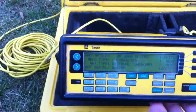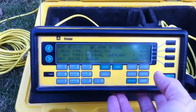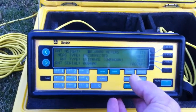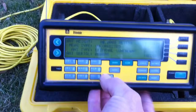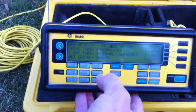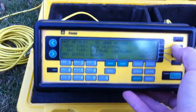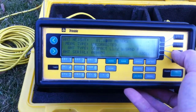Get ready to input antenna height. This is an uncorrected height. You're going to have to read up on the manual about the required format. I think this is a slant height when it says uncorrected, but please check that. I'm going to go ahead and enter the height as 1.5 meters. You can come down here and enter the antenna — it will be uncorrected. Compact L1, L2 with ground plane — that's the correct antenna.